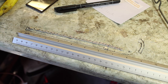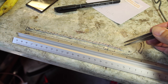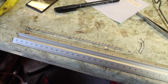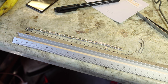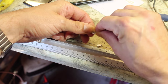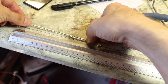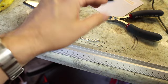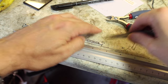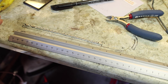I could use a jeweler's saw, but these extra links are just going to go straight into the scrap pot, so I'm just going to use a pair of wire cutters and snip those. If it was a thicker solid curb chain then obviously I'd have to use a saw. So with a pair of Tronex oval head cutters, just snip that and take those links off. Before we do any soldering, let's just double check the length - if I solder that onto the end there, yep, that's going to be absolutely perfect.